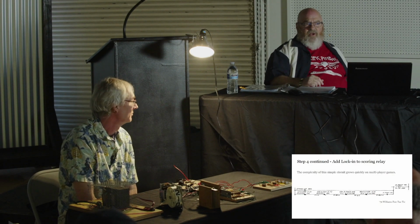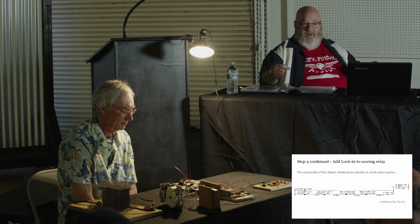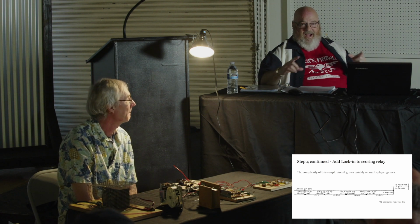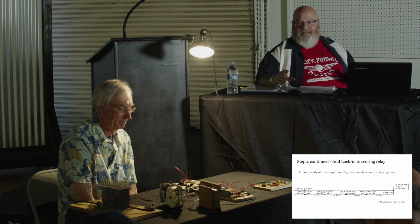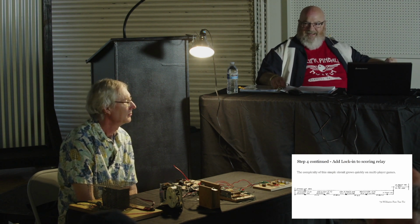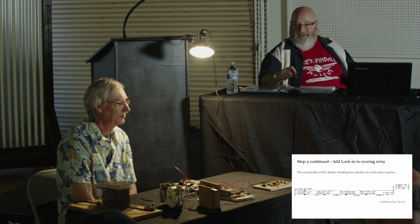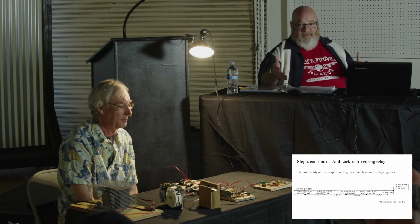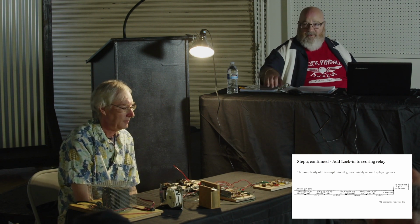There are a lot of times where, probably for economies, you'll have a relay that fires 2 pop bumpers. So if you hit either pop bumper, they both pop. I don't know why they designed it this way, but both end of stroke switches have to open to make the circuit drop. If a wire is broken to one of those coils, the relay turns on, one of your pop bumpers fires, stays fired, and if you haven't caught that problem is happening, you'll burn up that coil, you'll blow a fuse, and then you'll have a game to fix.